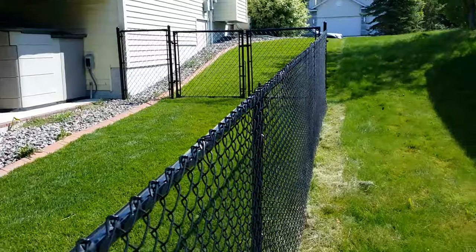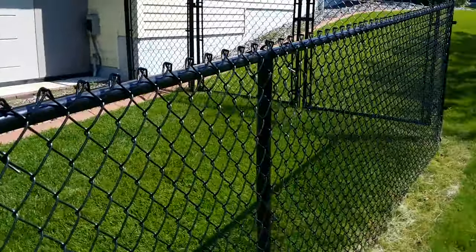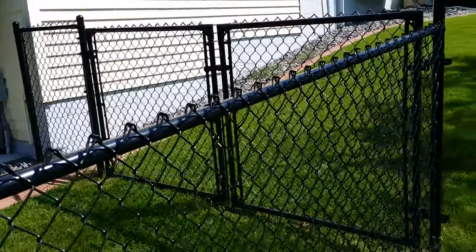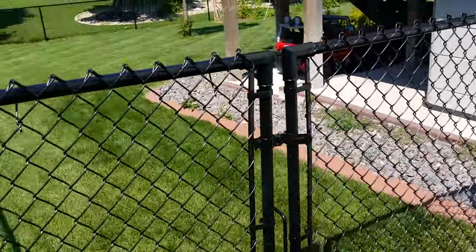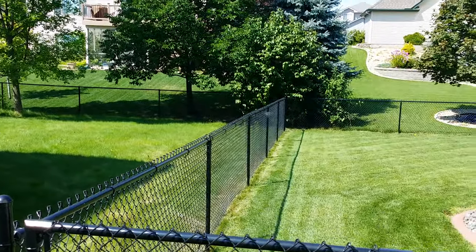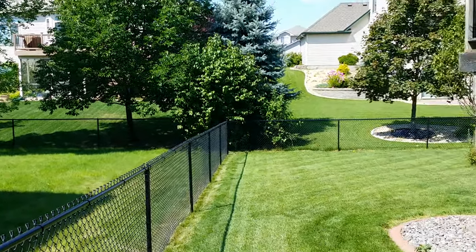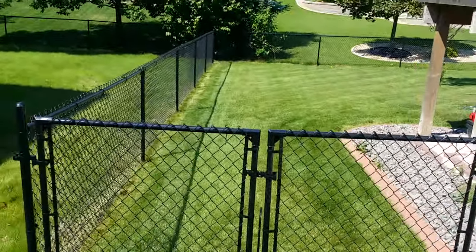All our posts are driven 42 inches below grade to prevent any heaving. It's kind of a wet yard, so a lot of times the cement will get pushed up over time from the frost. So that's it.